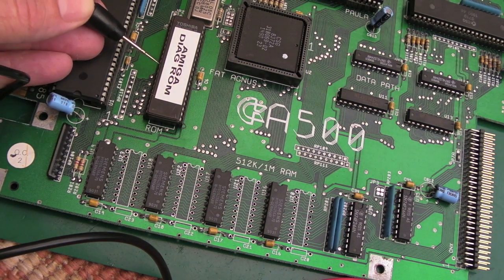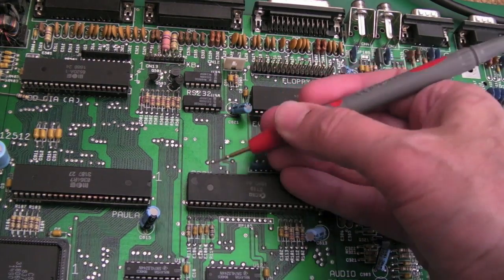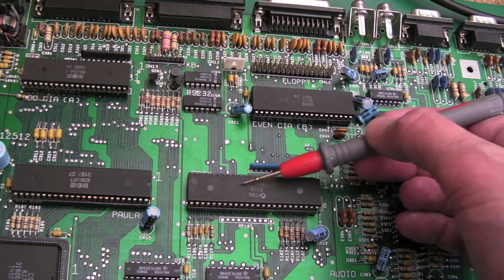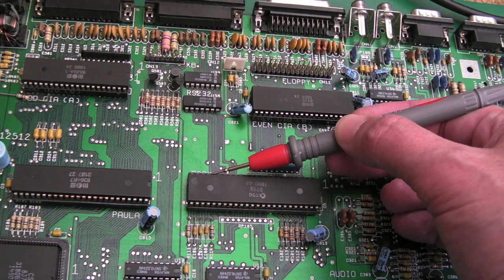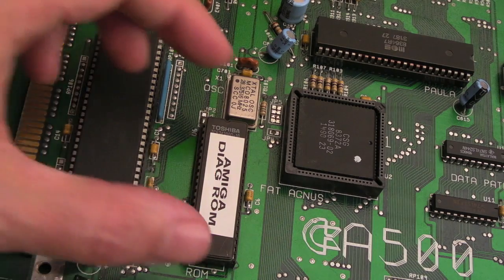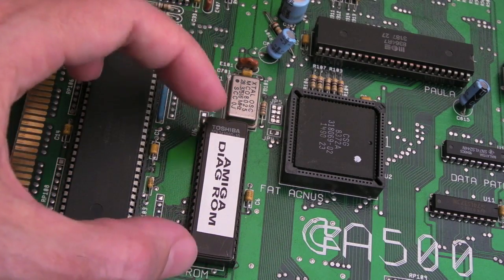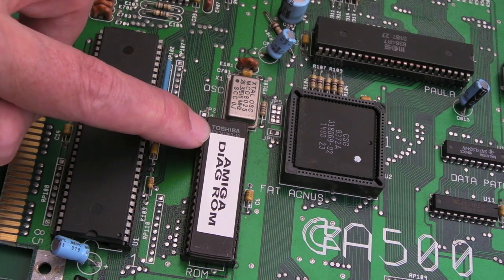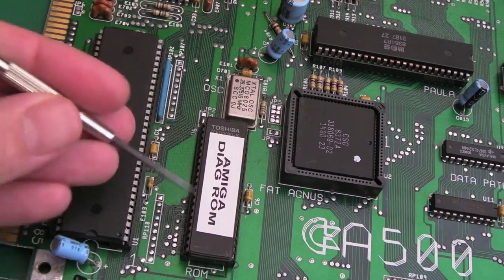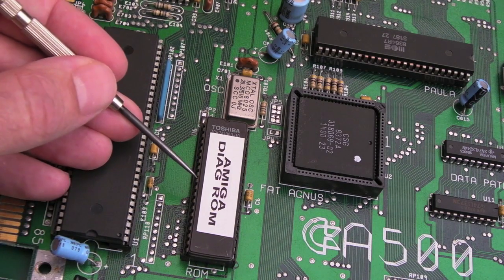Before I forget, I wanted to test that ROM output enable. Counting pins on the ROM - one through twelve - and then testing on Gary, one of the top pins, yes, the fourth pin down. So the output enable comes from Gary, with some address decoding for ROM control. If you see one of these where the output enable on your ROM is stuck high and it's not booting, you're looking at Gary. I lost the footage programming the EPROM - had problems with the programmer - but I used a 27C400 equivalent. Make sure you don't confuse it with a 27C1024 since the output enable is on pin 12 for the 27C400.